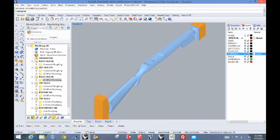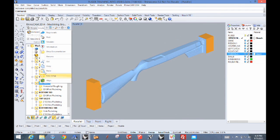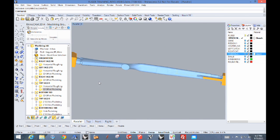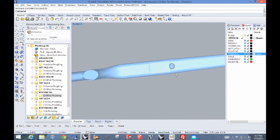I still need to do a couple more things I can't get to from the side, and one of those is the barrel groove. We're going to rough it out first — you'll see the rough passes — and then a finish pass. The difference between the rough pass and the finish pass is pretty much the step over, and rough passes will go multiple levels sometimes. That completes the barrel groove machining. Now we've got one final operation — a little 3D surface we have to cut down on the bottom. You'll see how that gets machined out. And that completes the 3D machining. We basically have a stock — all we need now is the inletting.